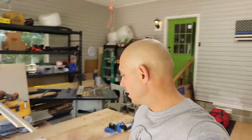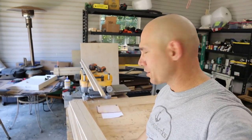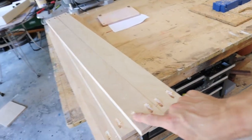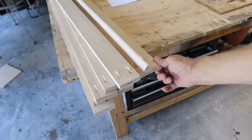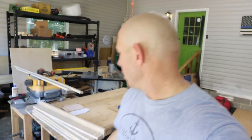While I was out painting, Miss 731 Woodworks was in here drilling pocket holes. We've got pocket holes on each end of all our slats. I'm going to sand those 120 grit, just a light sanding to get those burrs off. If you've got a really sharp Kreg bit it won't do that, but as they get older they start doing it a little bit. On the top side, just knock that edge off so it doesn't cut the bottom of the mattress. We both got tons of splinters doing this, so keep that in mind.